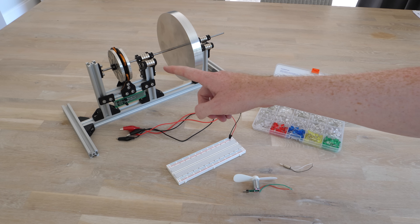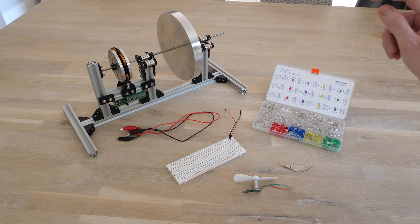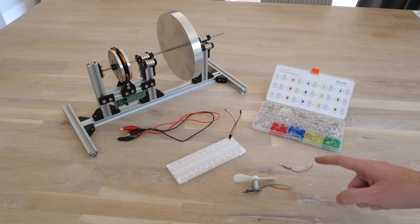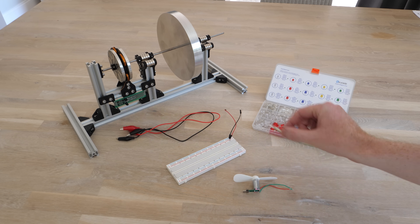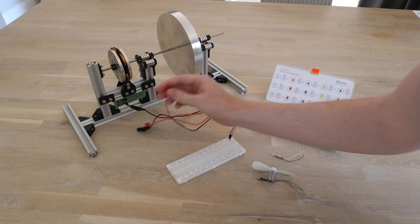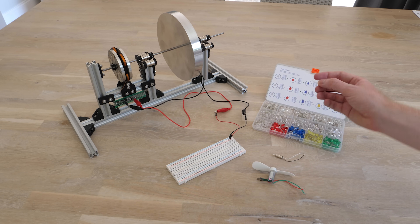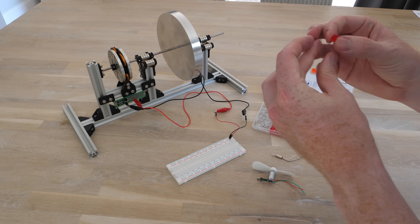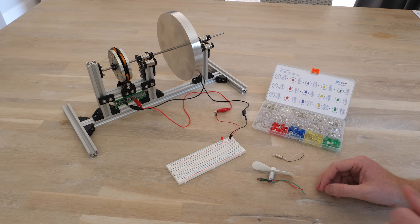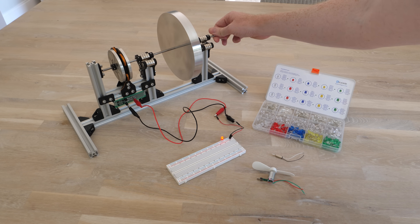Now that the alternator can produce much higher voltage, I think we should try and power some stuff. I've got a whole bunch of LEDs here — if we can get these to glow then maybe we can move on to something with a bit more power like electric motors. So let's hook up the full bridge rectifier with crocodile clips to the breadboard. I'm going to try these red LEDs because they have the lowest power consumption, so this should be easiest to glow. Plug it in and give it a spin — can you see that on the camera? It glows at really low RPM on the flywheel.